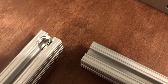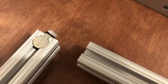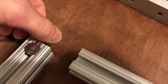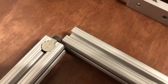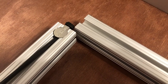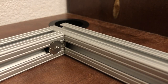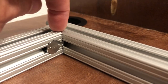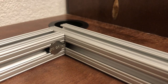Those pre-drilled holes are perfect for the little mounting pieces. This is the way it's going to work: this guy turns this way, slips into the 80-20, and then you tighten it with an Allen wrench — boom, you've got a secure connection. I'll put those both together and show you guys how it went down. Tightened it through there, the other piece was attached, and now I've got a nice 90-degree angle holding that together.